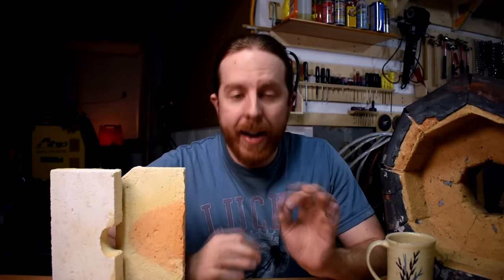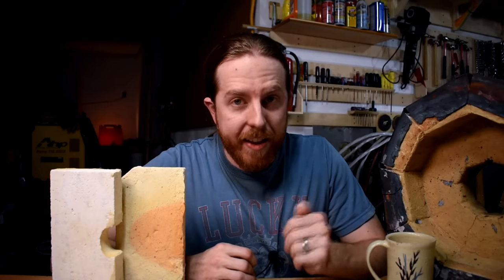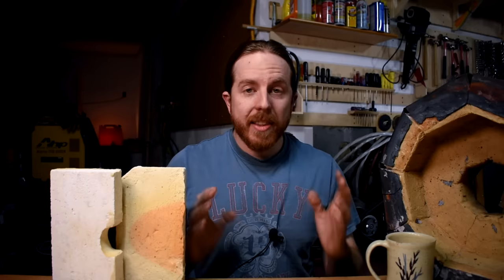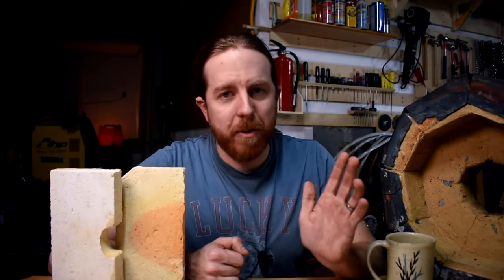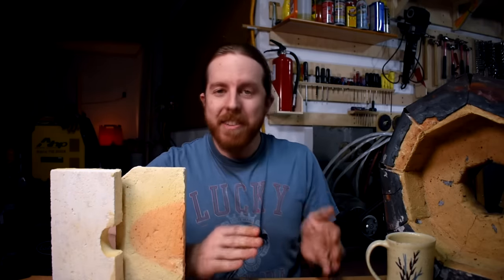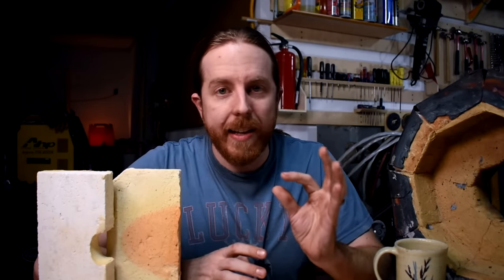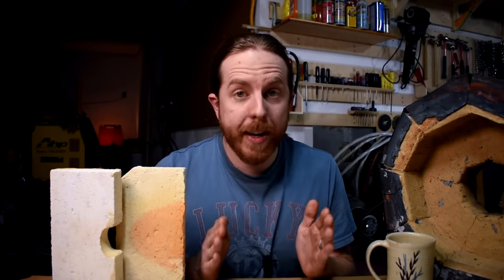These giant kilns are usually reduction kilns and you don't want air leaking in. You can't just seal the door up, so they take soft bricks and hard ones and cut them to perfectly fit inside the opening — no gaps. But after a few firings, about a thousand hours over 2000 degrees, those bricks suddenly don't fit very good anymore. They shrink ever so slightly. You've got to start shimming them — cut little thin ones you can slide into the openings. The shrinkage is the problem I'm having right now.